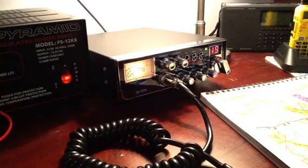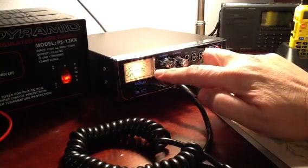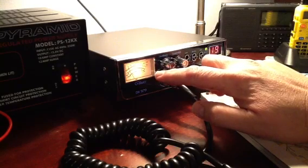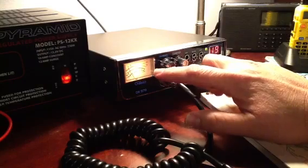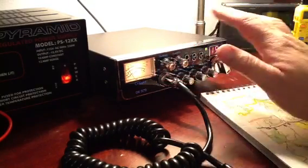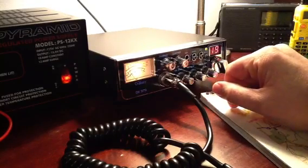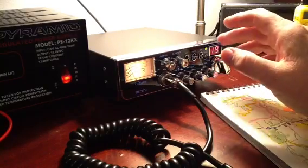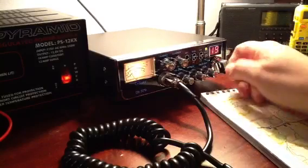I'll point out a few of the features on the unit that I like. There's the large S-meter right here, which gives me a good opportunity to see my SWR when I'm operating. You can actually check that while you're keying the mic. You're supposed to have as close to 1-to-1 as possible, and I'm running about 1-to-1.2, 1.3 at worst — pretty good. That's with the antenna as it came out of the box, preset for optimum, and I haven't had any trouble getting plenty of good contacts.